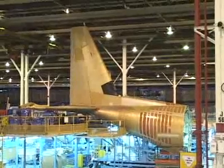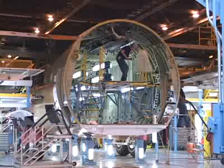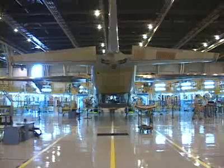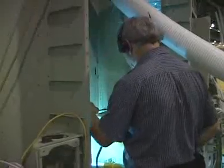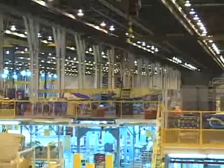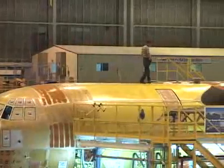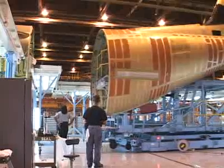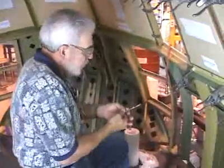Because C-130s are so big, they're built in sections. These sections break down into the forward, mid, and aft fuselage — the body of the plane — and the left, right, and center wings. The assembly line is broken down into stations dedicated to building these sections. All sections are built simultaneously and move down the line as they near completion, moving toward the final stage, which is body mate. This is where all of the large sections are joined together to become a whole plane. It takes over 60 mechanics several weeks to carefully assemble these pieces and build a C-130.